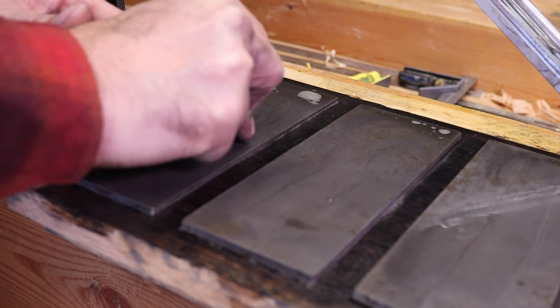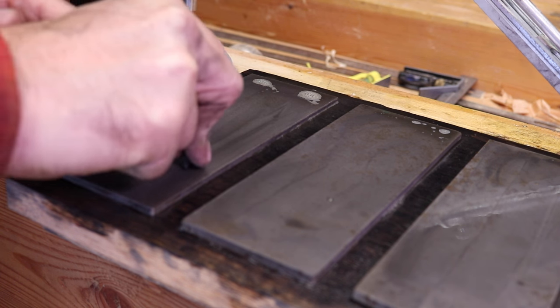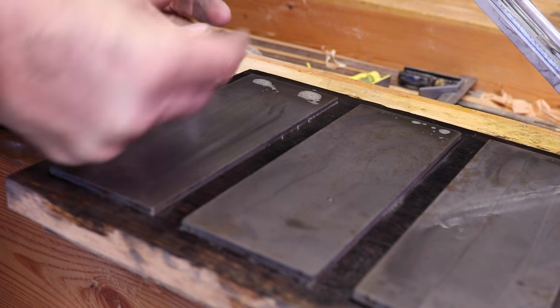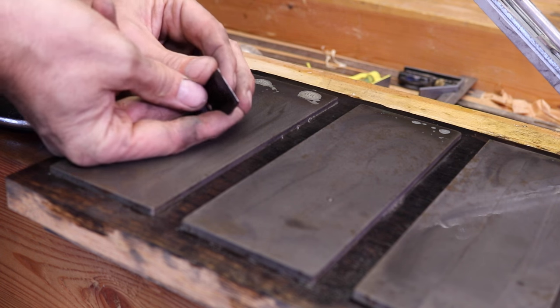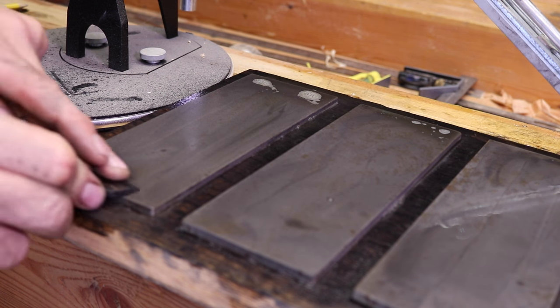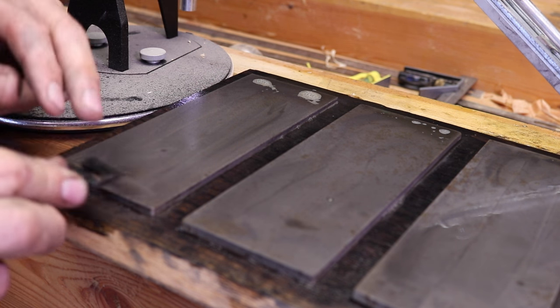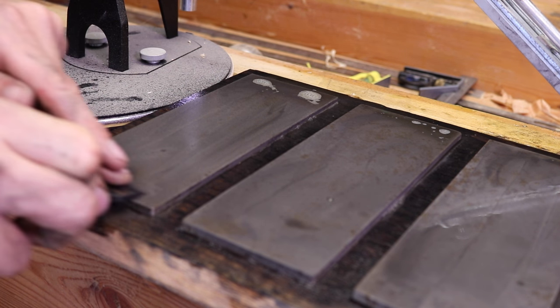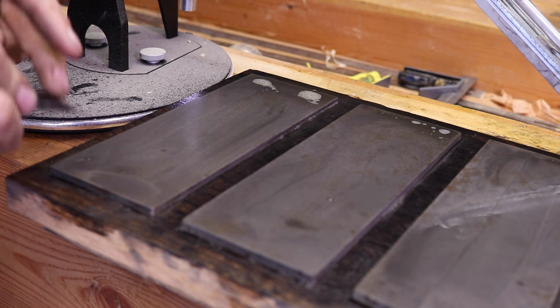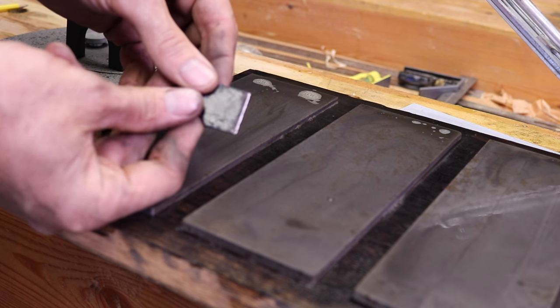We'll just flatten that out. It's just a little bit rough. Got a little rust on there. Get a nice, there. So look, we got a nice machined surface on there. And right here where it comes in contact with the iron, clean that off. Just get some consistency in so it presses equally on the iron. Let's see. Yeah, that looks better, doesn't it?